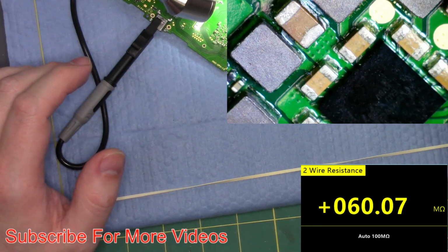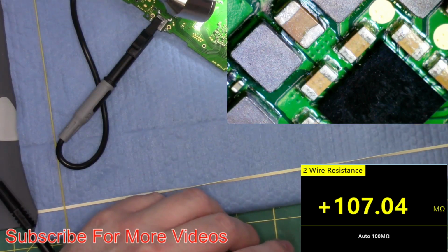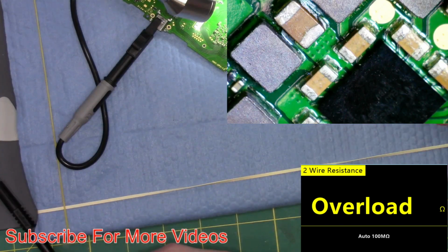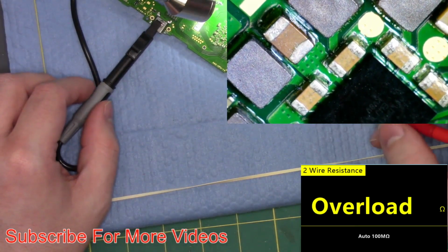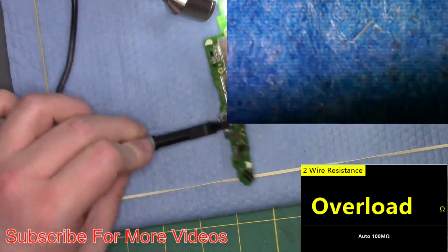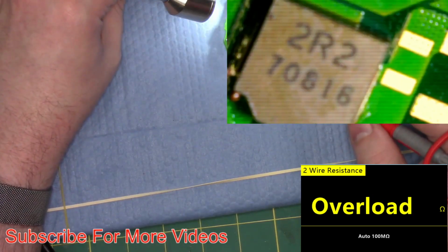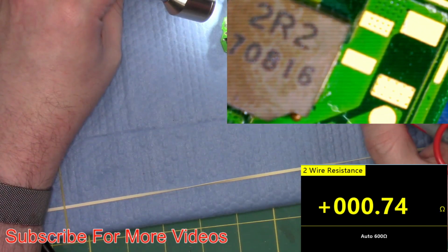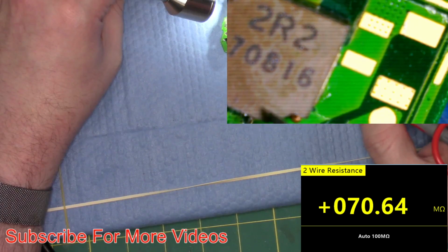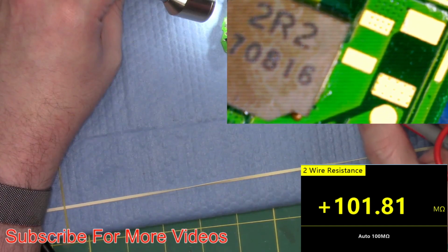And you see that a lot on electronics, where you have different power rails. Sometimes you have a 3.3, a 5 volt. The lowest I've ever dealt with was 3.3, and I don't know what the power rails on this switch are. I know that if you plug it into the charger, it'll ask for 15 volts, and then you have an inductor here and some filter capacitors that probably step down the voltage to 4.2 volts to charge the battery. That's probably what this does here.